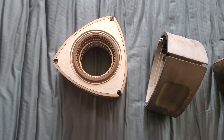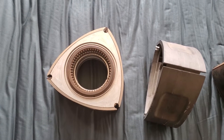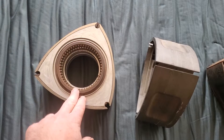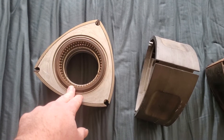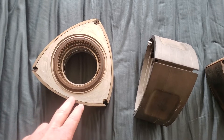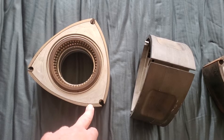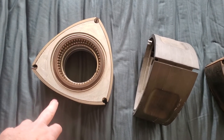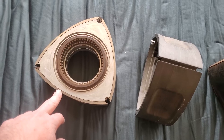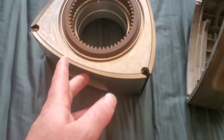A lot of this was to reduce cost, reduce weight, and try to be as light as possible. We didn't want to have to make our own stationary gears, so using the OEM ones just seemed more practical. This also gave us a way to create our side seal groove. We were always worried about titanium alone having the stickiness that it does and the seal tolerances that Mazdas do have.